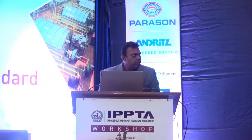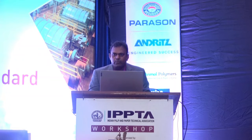If we take wheat straw, the major issue is the almost 4.5 to 5% silica content. This is one of the most major issues for the pulping process. Normally the silica content is much higher in the leaves than in the other parts, so it is difficult to remove the silica, but we have some technology or system to remove it. And the node portion has very strong fiber bundles compared to other parts, which normally creates more shives. That's why nodes also we have to take away before the cooking process.